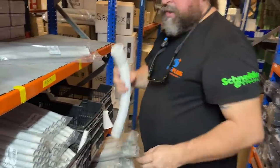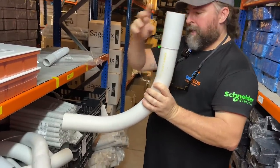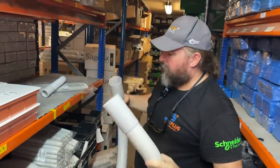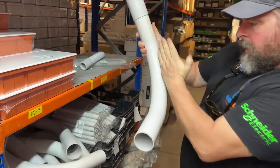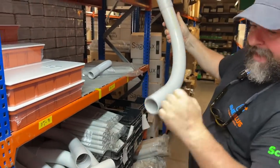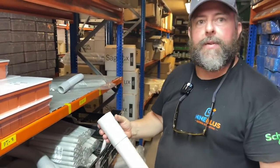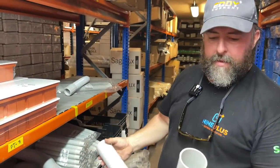Okay. And then we get rigid connectors, 63mm. Comes with two couplings, and you can join on as many bends as you feel like. But there is a maximum of three, as we know, too many bends. It does kind of snag up because the cables go around to the top, to the bottom, and they actually lock up. So we use a gel here as well to be able to introduce cables and to take cables out. There's one that breaks down any debris, and the lubricant is water-based.